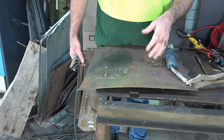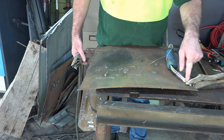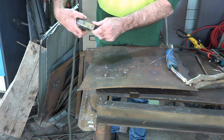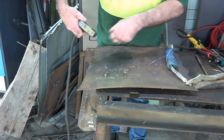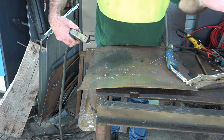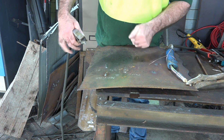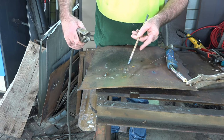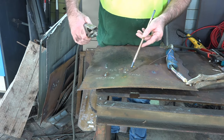Remember guys, if you've got your torch vice-clamped down like this, never leave your earth lead on there, because the earth lead becomes the electrode for whatever you're doing. If you leave that on there and go and turn your machine on, the whole lot's just going to blow the fuses - I've done that once or twice before. Anyway, we'll use this as my electrode holder and put our carbon rod in to see if we can actually make some sparks.